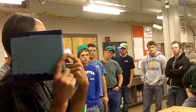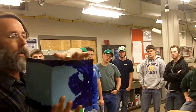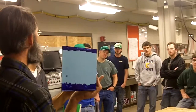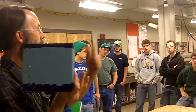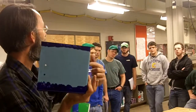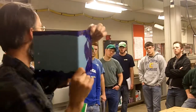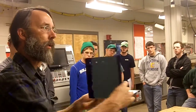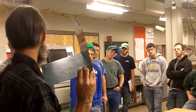Good guess, not 1.5 inches. No. This is 1.5 inches this way. It's 3 inches, right? This is going to be 3/4. So set up the dividers over there at 3/4, set up the dial caliper at 3/4, center punch, scribe your line, and then we can grind off this excess, and then we can take it to the sander and sand off that excess, and come up with a perfect radius. Okay? So there's plenty of work there to do.